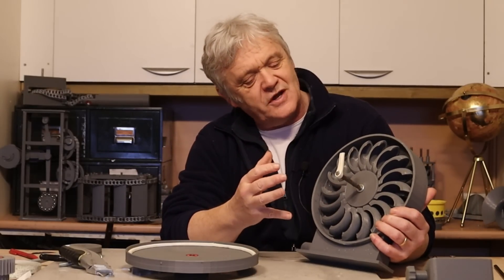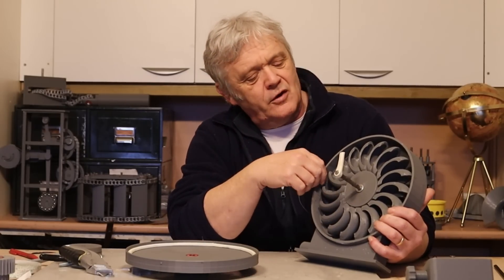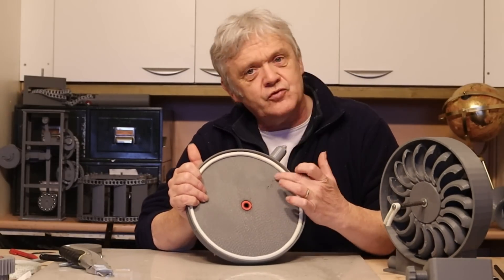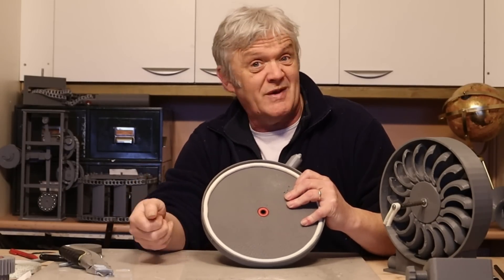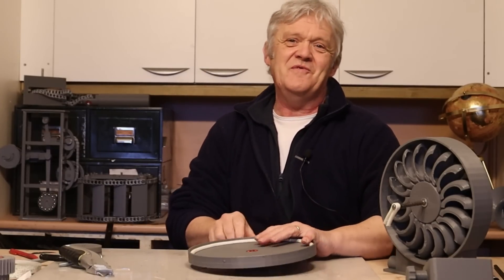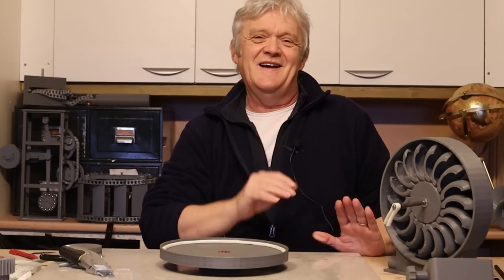For me that was a learning experience. The housing worked really well — the water didn't clog up and drained out nicely. I was worried it would be too big and cause splashback, but that worked nicely, though maybe we want to shrink it down a bit. The inlet holes are more questionable — three 2mm diameter holes didn't deliver water with much force compared to just putting my thumb on the end of the pipe. I'm thinking those holes aren't a good idea; we could look at a slot and take it down to one millimeter. I hope you enjoyed the video — I'm going to pursue this further, although perhaps not as interesting as the fact that you can just buy these if you want. Thanks again.